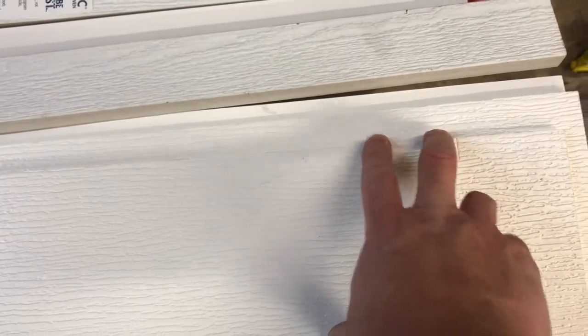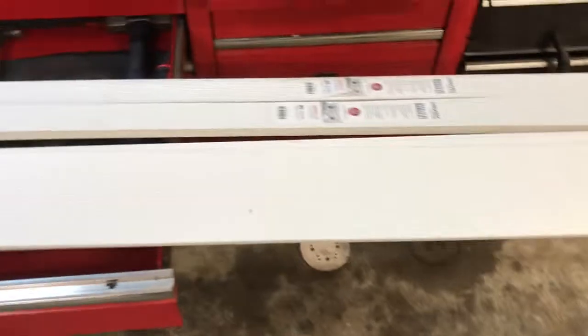These little uprights that come down are actually just going to come right down to the top of this PVC board, and then we cut on a 15-degree angle. We should never have another moisture problem that will rot wood — at least that's what I'm hoping for. Let me go up to the store quick to get some spray foam and we'll get right back on this.